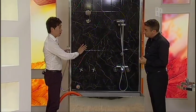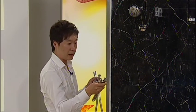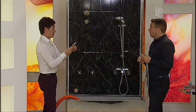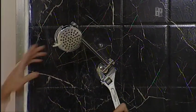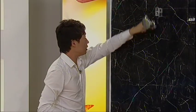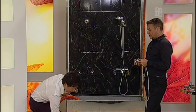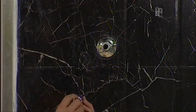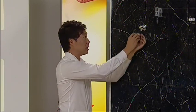All you need to do — you don't have to turn off the main water, just make sure the two taps are closed. Then simply get a shifting spanner like that. And just slide in to the right size and turn anti-clockwise like that. Then once that comes off, just unscrew it. You may want to put some plumbing tape around the thread. And when you install our bracket, you don't need any tools — just use your hand.